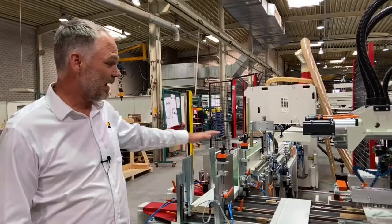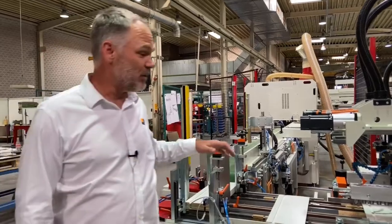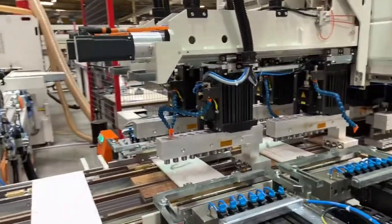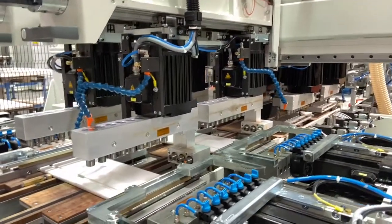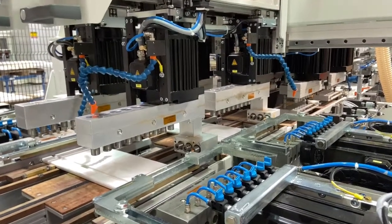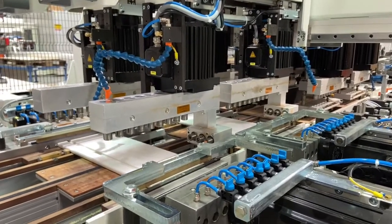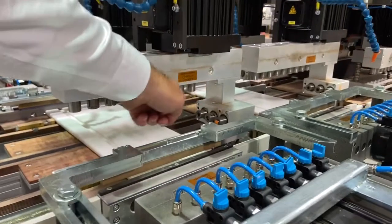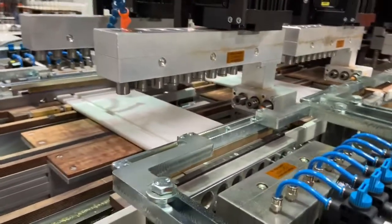This machine is magazine fed. The basis of the machine is that we use a double cycle — that is, we will move two parts into the machine at a time. This is the first drilling station that will allow drilling horizontally, vertically, as well as long end drilling in double cycle.